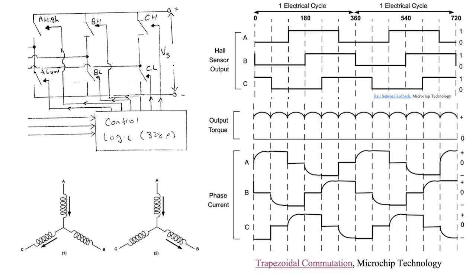Depending on the direction of current going through the coil, a different direction of magnetic field is created in the stator. Each motor phase pair is energized by a positive or negative electric current in a specific sequence, and a 6-step commutation sequence is required to complete 1 electrical cycle in a 3-phase BLDC motor. The first 2 steps of a given sequence are shown in the diagram on the bottom left, and the phase currents in phase A, B, and C are shown in a diagram of trapezoidal commutation by Microchip Technology. I'll link this source in the description because I think it's really useful for understanding these concepts.